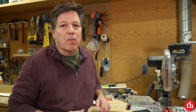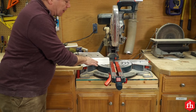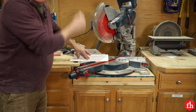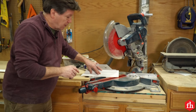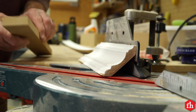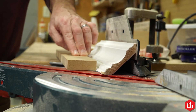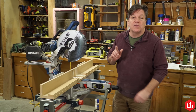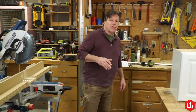The non-compound method of cutting crown molding refers to resting the top of the molding against the table and the bottom of the molding against the fence. Then you just set your saw at 45 and you're good to go. The problem with this is that when you're cutting, the piece can slide down — not a very safe thing. So you need a stop block. You want to adhere a stop block to the table using carpet tape or even a spot of hot glue and pull it off later. Or you could make an auxiliary fence like I did — here's my auxiliary fence. It's basically a table and a fence with a stop block attached directly to the saw.